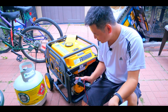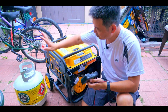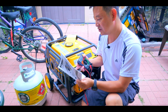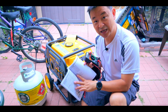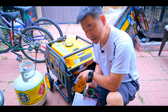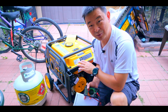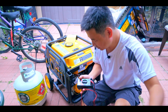Let's get started. Before we do that, we need to check whether the battery is fully charged. Right now when I measure it, it's 11.78 volts. That's very important because if you're going to run it on the propane tank, it uses an electrical spark to get started, so you need the battery. The manual even mentions battery charging and maintenance on page 30. I remember watching videos where people couldn't get their propane tank to work — the key issue is that the lead acid battery is not fully charged.